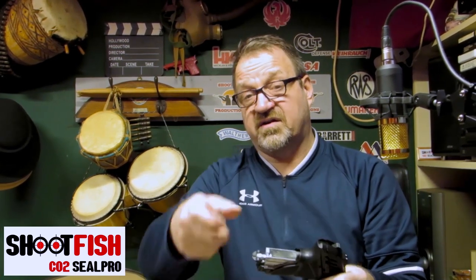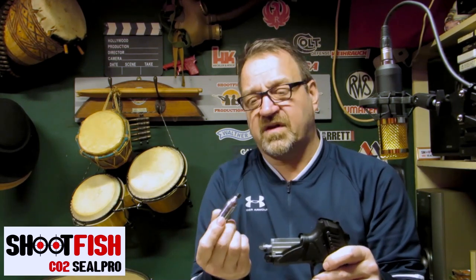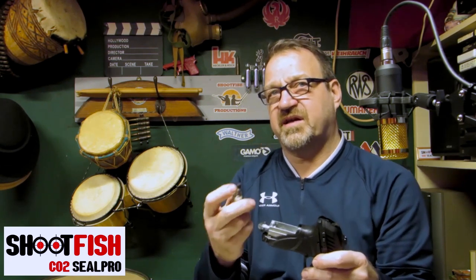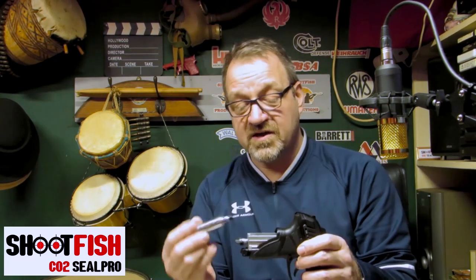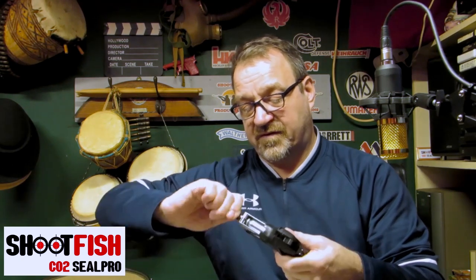That gun actually does leak if you don't use one of these. We're not saying you have to have them — PTFE will do it — but this is so much easier. These are reusable, I would say two or three times possibly. They look a lot different once you pull them out because they form to the seal. If you've got any gas left in your tank when you release it, that will freeze the rubber, and if you try to pull it back into your gun too quickly it will crack rather than seal — so let it get back to room temperature first. You drop it into your gun and tighten it up as normal without overdoing it.